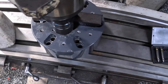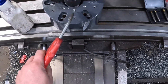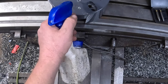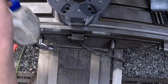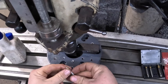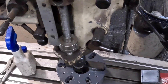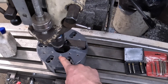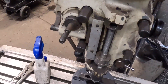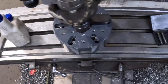Make sure you're spinning in the right direction — left-handed. I've had a lot of these that would spin out just from that little left-handed drill. Glad to see this bolt's not too hard — that always adds a level of nonsense to things. One of two things will happen: either it'll spin right out, or it'll strip out in the bolt. I have broken them before but it doesn't happen very often. Try not to get too aggressive with the speed.